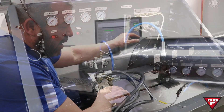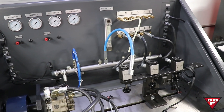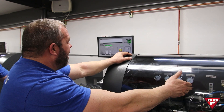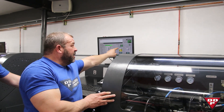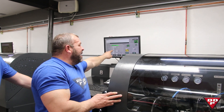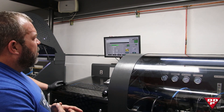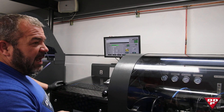So we've got an actual CP3 pump here, and the CP3 pump is feeding a rail. It's basically designed like a Ford Power Stroke — it's going to regulate our rail pressure. We've achieved 160 MPA, our pump RPM is 1000, we're shooting for 1700 microseconds at 160 MPA. Currently it's counting 132 mm cubed. We've got 5 seconds left up there in the top right corner, and then it's going to go into a return.